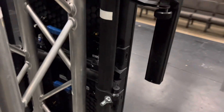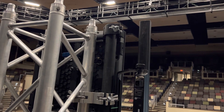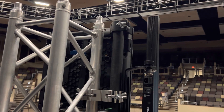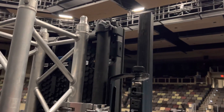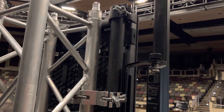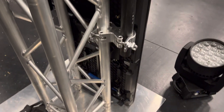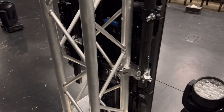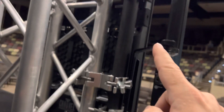We will also do one clamp on the top corner. Because this one is on our far left as we look at the stage from the lighting perspective, we're going to do this one on the outside corner. So we have this one pipe here — the support pipe — which will connect between these two clamps on the outer edge. It doesn't run the entire height, but it's about five or six feet maybe.